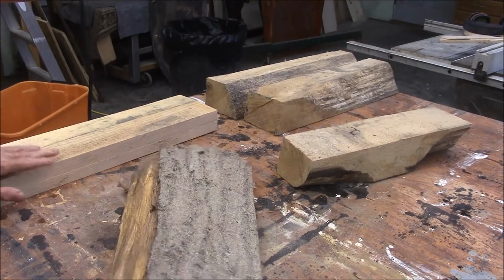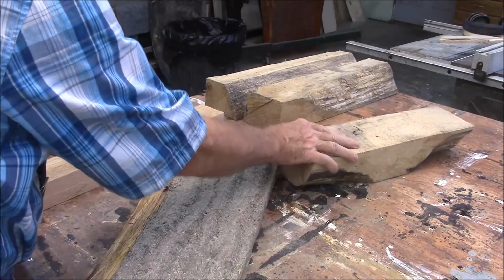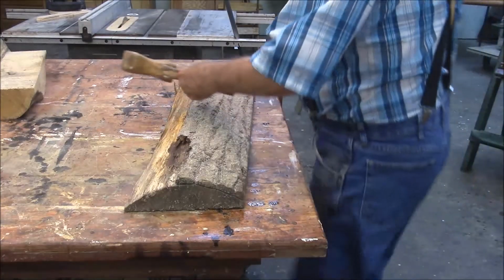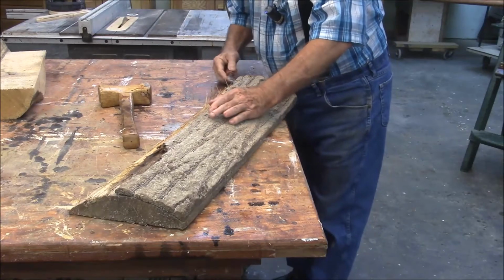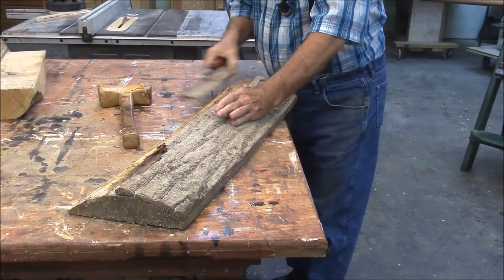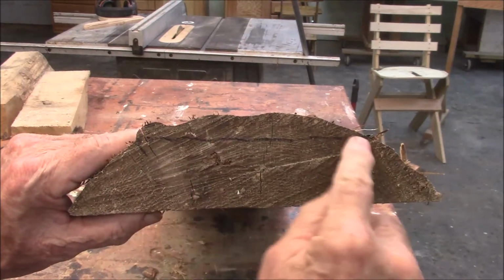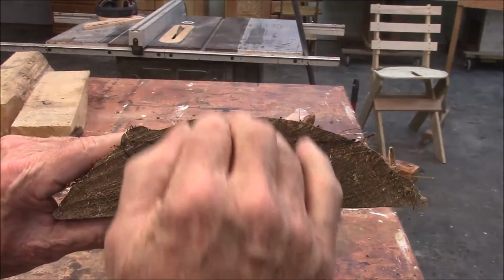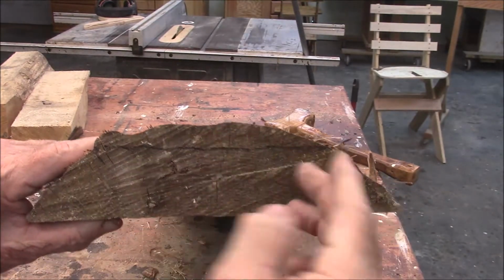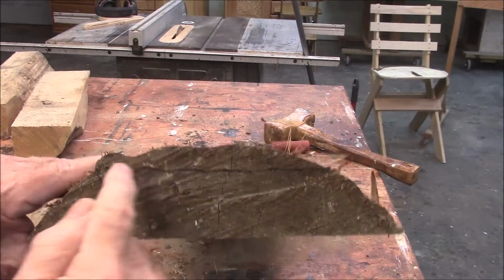This is the firewood we're going to try to use. I've already cut these pieces right here, but we're going to plane them and join them and cut them and everything. Okay, first piece of wood I'm going to deal with is this piece that's got the bark all over it. I'll take the bark off. You can see on this board, that line across there, that's a little bit over 1.5 inches. I will plane this down until it's about 1.5 inches thick, and then I can cut my board off where it intersects the radius here.